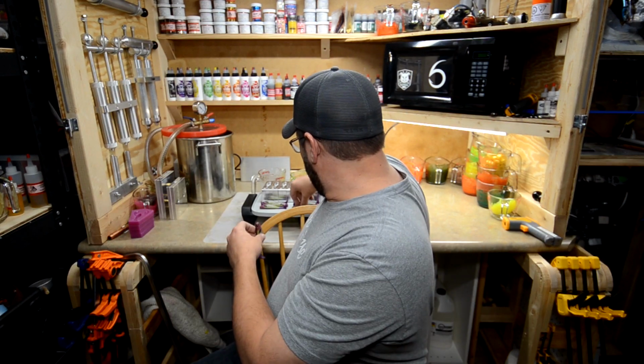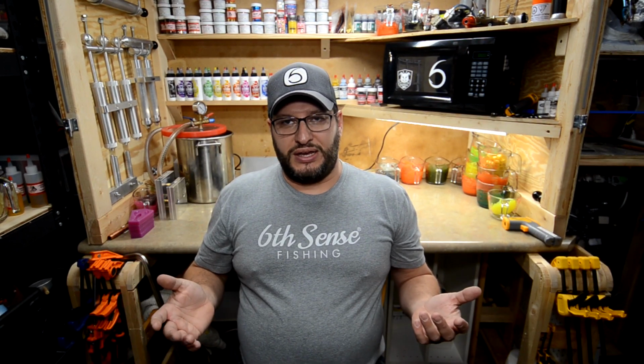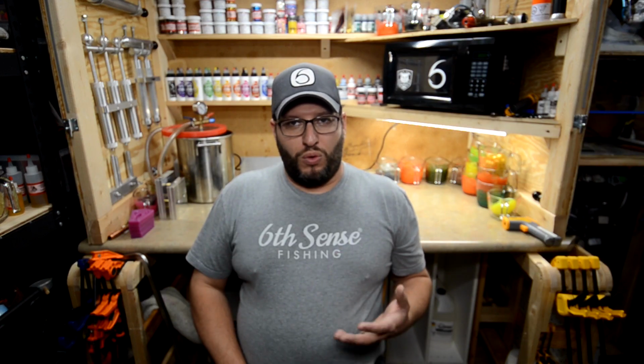But anyway, that was a good example today of some basic dusting technique, just how to skin pour with some basic things like coloring in the heads and the gill plate and the fins, just giving you guys a good example of how that actually works. And then the process is pretty time consuming. You're heating them up on the griddle and then you're doing the pouring after you do all the dusting and the first pour with the skin pour. It gets a little bit chaotic, but well worth the time it takes.